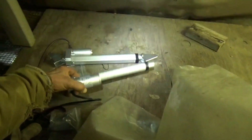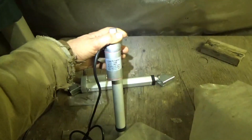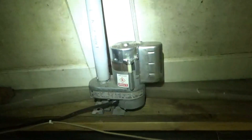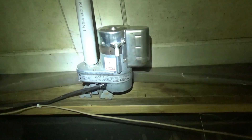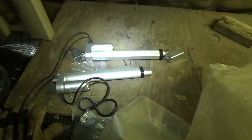So I ordered some linear actuators with that gift card. And here they are. These are DC linear actuators, 12 volt. I think they do about 200 or 300 pounds. The other ones are rated at like 700. But the power consumption they were drawing was like 340 watts when both of these were going to open vents. Plus we had to turn on the inverter, and that was a whole coding pain in the butt. When the inverter had an issue, it would trip out. So we're going to eliminate the inverter now that we can do that with DC linear actuators.